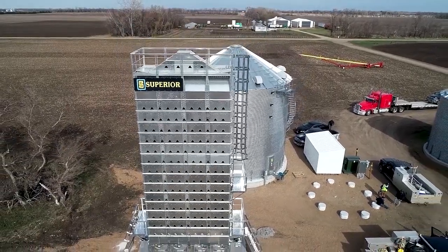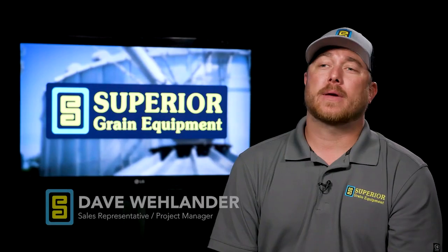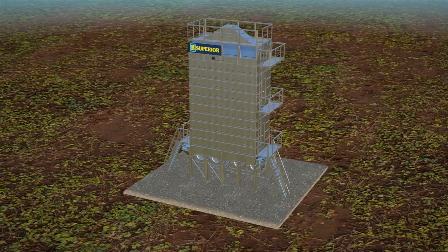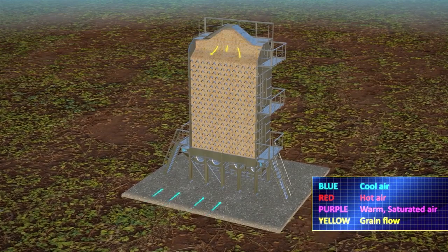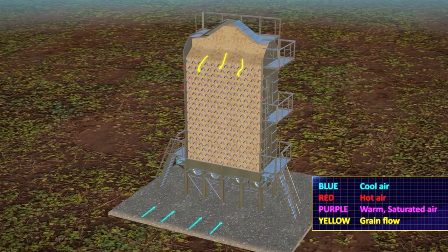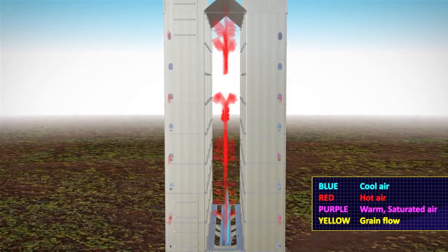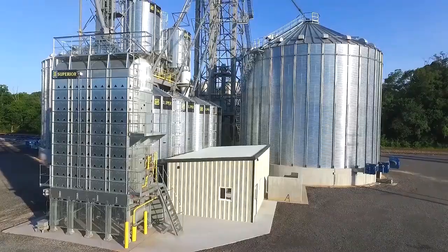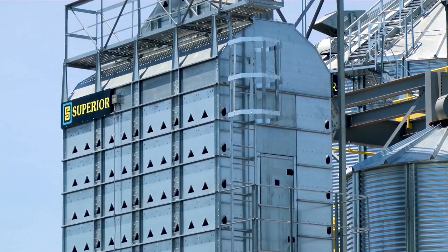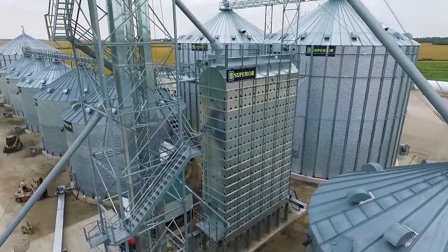Superior's continuous mixed-flow style grain dryer offers several advantages in efficiency, flexibility, and quality. One of the big benefits to an under-fan mixed-flow is even heating from top to bottom, front to back. We heat the grain up gently as it's going through, so less heat means less stress fracturing, and gentle heating and even cooling means there's going to be less damage to the product, which means more dollars coming out. With a lot of other dryers, you're looking at 80 to 100 CFM per bushel to run them, and a mixed-flow rack dryer, you're looking at around 45 CFM per bushel — half the air, half the BTUs, half the energy costs typically.